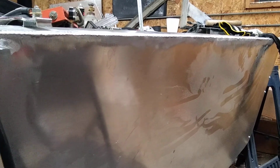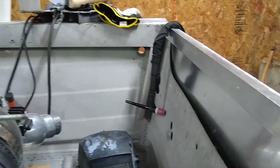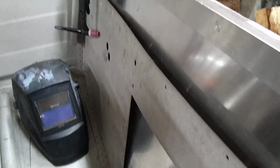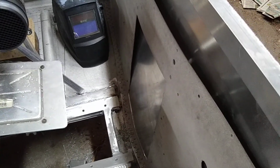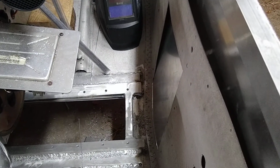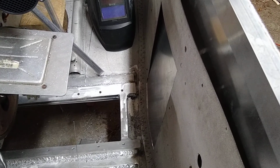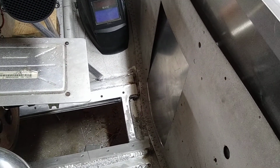So it's essentially welded just to the outside of the old transom, basically. But it's going to be tied in multiple places on the inside. I think what the plan is in here, we'll cut the hole out once the perimeter is welded for the pump to go through. I'll probably have to weld the bottom of that hole from the inside, because it goes right down to the very bilge of the boat, so I could get in there to fabricate this intake flange.